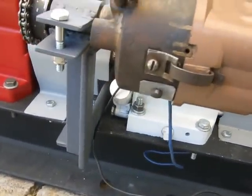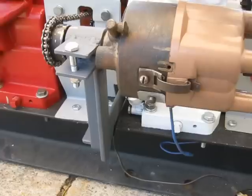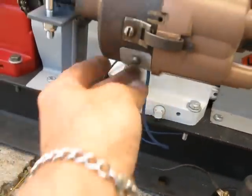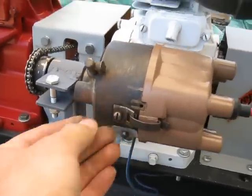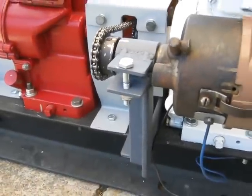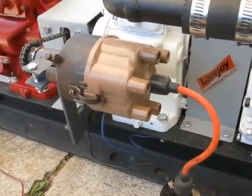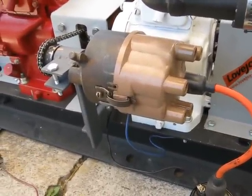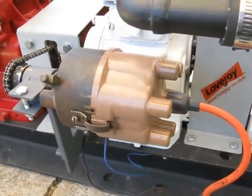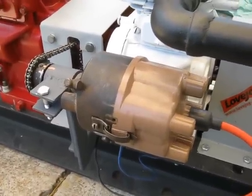Right now I'm working on a ground wire from the negative battery terminal. I'm going to lead it right back to the same place I've got the distributor grounded. The distributor has its own ground wire here - I don't trust my distributor mount to ground it since it's been painted and all that, so I want an actual ground wire. I'm one terminal short to connect the wire to the frame, so I'm going to make a wire end terminal out of copper.